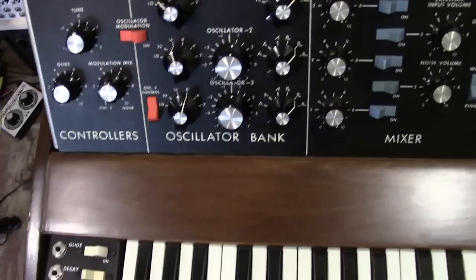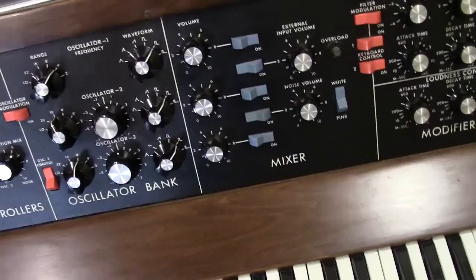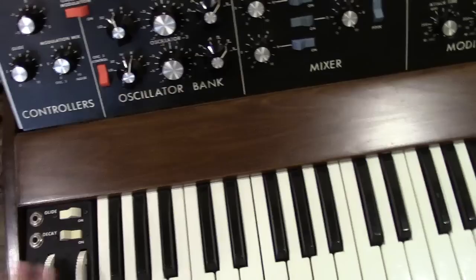So that was something I found. The big issue he had though was actually with the frequency and accuracy of his tuning — it was like a scaling issue. I'd turn the oscillator to 4, do a calibration, get it right on the dot frequency-wise. I'd knock it down to 32, calibrate his octave trimmer to make it in tune. But then whenever I'd play it in any other key, it would be out of tune. If I turned it back to 4, it would be fine and play absolutely fantastic in that range.